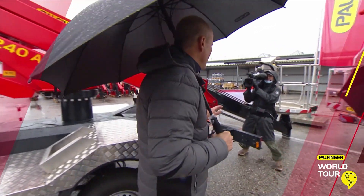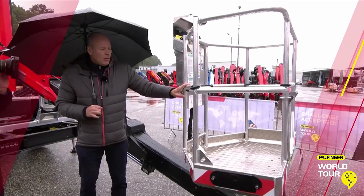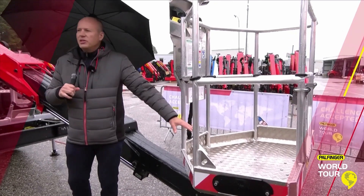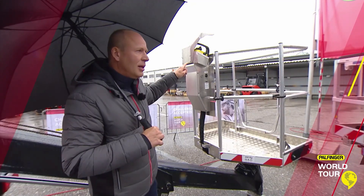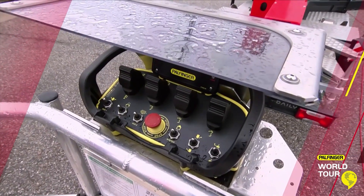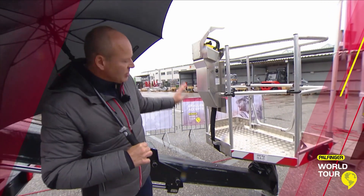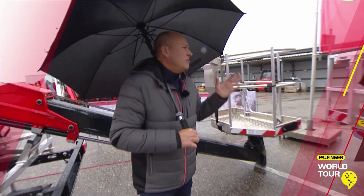Let's go further down to the cage. Here we have the new cage with different capabilities to enter. It's in a kind of operational mode right now, just to show you that you can load stuff into the cage from this position, which is much more convenient than before. Here you can also see the new electric control. With the new electric control, it's possible to have three movements at the same time, so you can adjust very intuitively where you want to go — very fast and efficient to get from one spot to another. We also have a coverage here, because for instance, if we go to tree trimming, you have coverage against all kinds of wooden debris or whatever falls down.